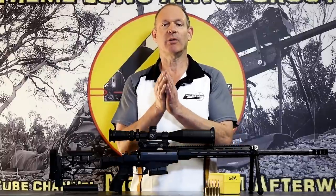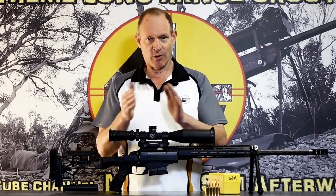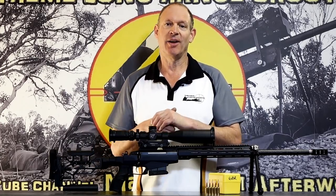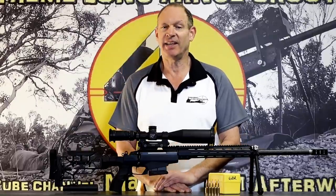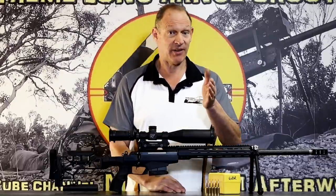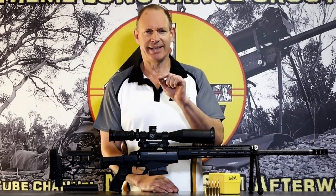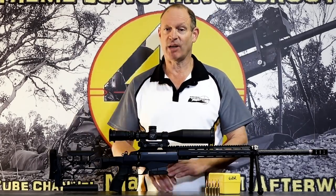And if you go through what a firing pin needs to be for a normally set up zero or up to 2 thou headspace round, then yeah, 55 thou, 50 to 60 thou, as a general thing, but 51 to 55 or 51 to 54 is the precise place. So getting it precise fixed the problem. It answered my things properly.